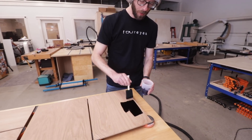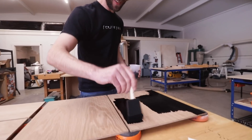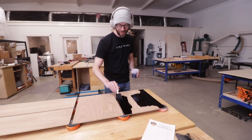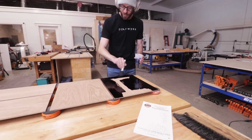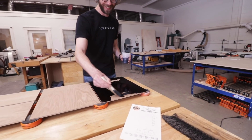In these shots, I'm using some leather dye to stain my panels black before we glue them up. This might seem redundant since we're going to ultimately finish them with black polyurethane, but the reason was I was worried the panel might shift over time and end up exposing a part that wasn't finished. So I wanted to have a nice base of black everywhere, kind of as a safety net.